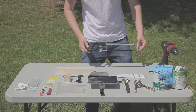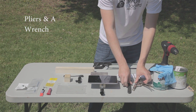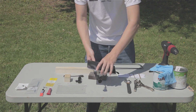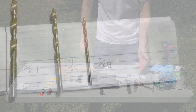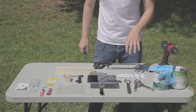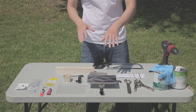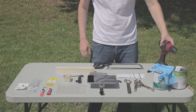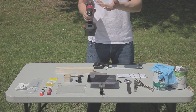Some of the tools we're going to use: a hacksaw, and pliers — it doesn't really matter which kind, but we're going to use pliers to lock the nuts into the wood. You're also going to need three different size drill bits: 15/64, 11/64, and 7/64. These aren't dead-on requirements — you can eyeball it — but these are the three I used. You'll also need paint and primer gloves, a power drill (wireless or corded), and a basic Phillips head bit.